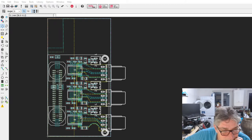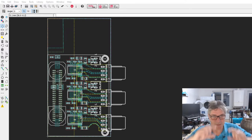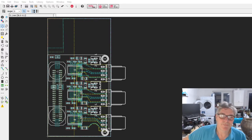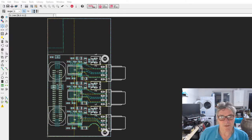The only reason I'm talking about buttons is because Laurie was going on about them the other day as well, not having enough. Laurie just said, I ended up using 4 physical buttons and an on-screen display. Yeah, I was thinking we could do kind of like a little button grid. Or you could even use keyboard switches, like Cherry ones. I'd probably get the low profile ones though, because otherwise they're just going to stick up like a mile. But you can get those tactile ones that are not very high. And you could easily do a 4x4 or a 5x5 array of those. But fitting them all onto a tile might be a challenge.